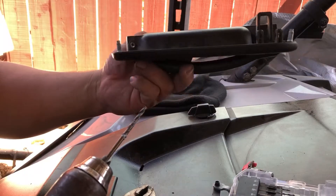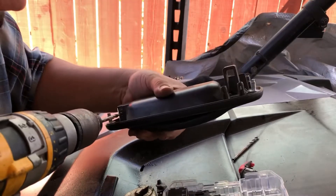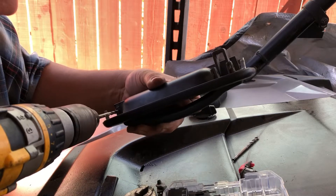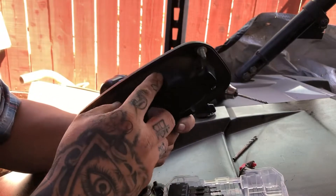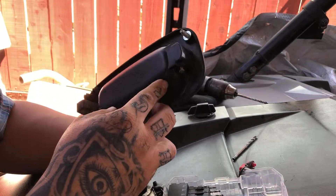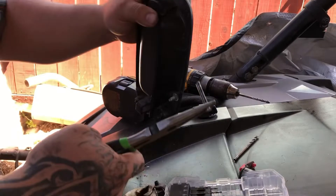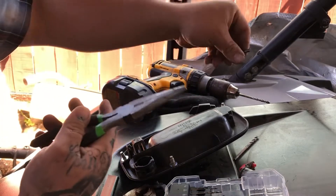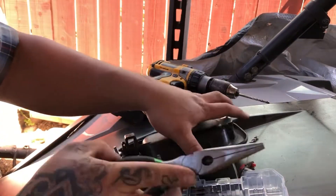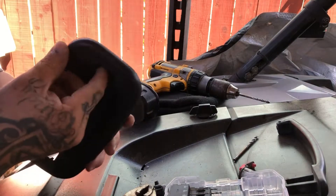We're gonna try to remove the last piece which is this spring pin. All I'm gonna try to do is just get rid of the mushroom head. Just pretty much take your time on this thing — you guys probably got a better way of doing it. By all means, I'm just trying it — this is my first rodeo I guess. Just work it little by little. You can see where I kind of wore down into it. So just take your time, you don't want to mess it up. But once you do that it comes off pretty easy and you're good to go.